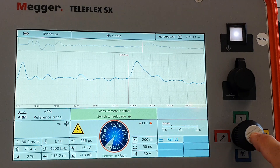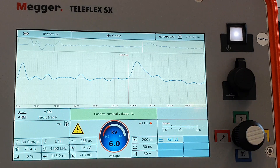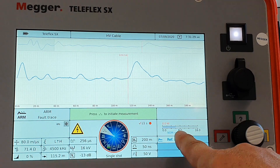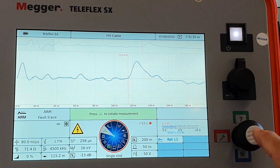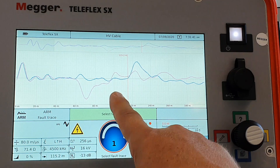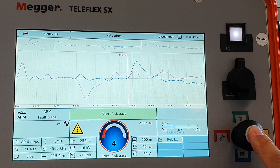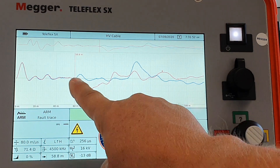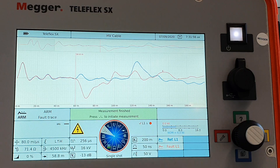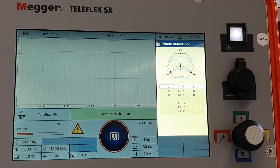Automatically it finds the cable end as an upward reflection, setting the range and the gain. I switch over to fault trace and give it a voltage slightly higher than my breakdown — I set it to 6kV with the range at 16kV. I start, the voltage is applied and flashing over, and I see trace 1 out of 15. I select the nicest one and confirm. My cursor jumps right to the fault position at 58.8 meters. This was the arc reflection method. The moment I leave this mode, the high voltage is automatically switched off.